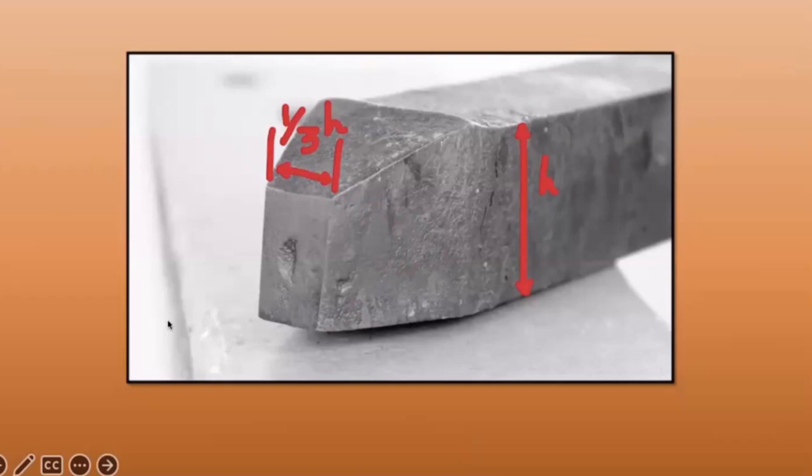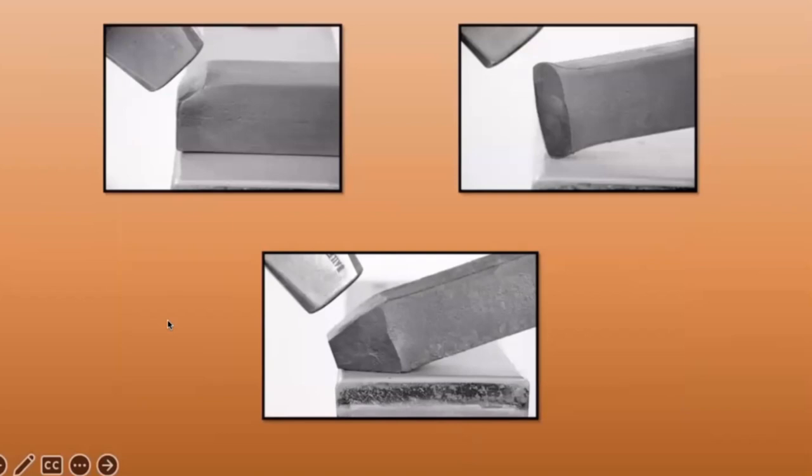When you're drawing this, we know from blacksmithing there's a couple of ways to make a taper. We can either squeeze the end out, or we can pull everything that's not part of the taper back out of the way. And you can see in the top left there that I'm actually pulling the material back, almost like an upsetting blow. And I find that this is important with this animal head, because this is starting to place material further back in the bar that I can capitalize on later for making the ruff that goes around the back of the neck and for the ears. So I like this way of doing business.